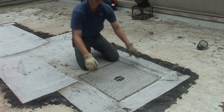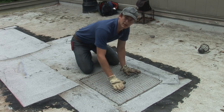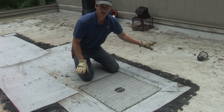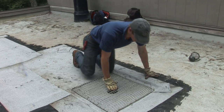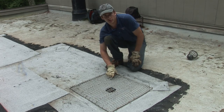This fits in perfectly right here. When a leaf or leaves come in here and start blocking this up, the water then just flows over the leaves onto this. This thing will block up much less — this will take weeks to block up where that old one can clog in like a day. This is an effective strainer, especially when you lower the drain like this and it fits in perfectly. This is the type of strainer you should have on your roof.